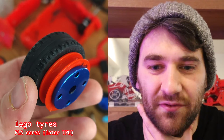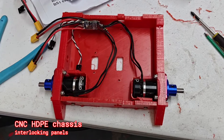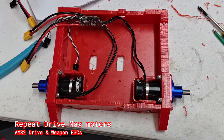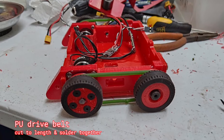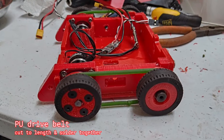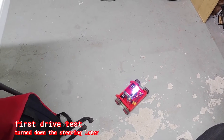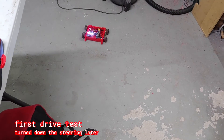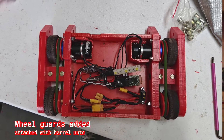First of all I decided to go with Lego tires — I'd run these on Lobster earlier this year and had a really good time. I made some 3D printed pulleys and an HDPE chassis as I normally do, mostly 10mm and 5mm HDPE. I was running RepeatMax on the drive with AM32 ESCs — all available at the BBB store, shameless plug linked below. I attached the wheels working together with some polyurethane belts and did a little dry test.